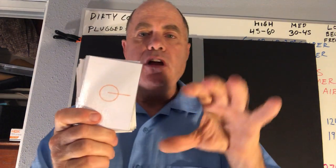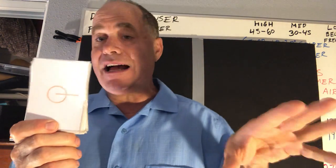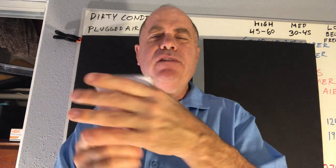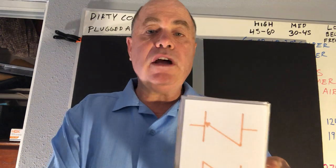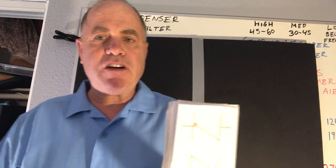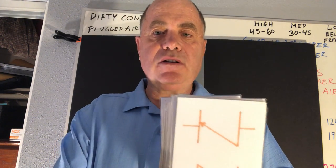I'm using a brownish-orange color for piping symbols, which we share with plumbers on blueprints. The actual symbols are official ASHRAE symbols; the colorization helps show how they relate to one another. This is a 90-degree down, like an elbow down. This is a T down — looking from above with a T going down. This is a check valve; you can see the arrow only allowing fluid to flow in one direction. We use check valves in refrigeration systems on heat pumps, and also on hot and chilled water systems. Here is a ball valve to manually close off flow.